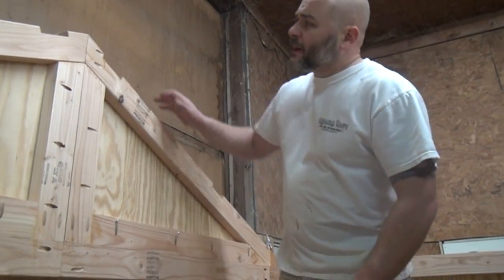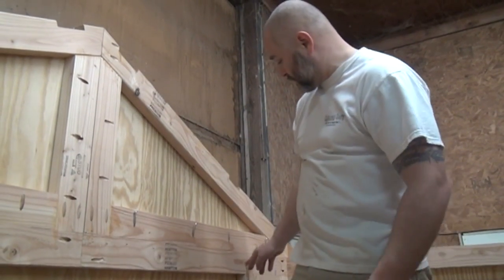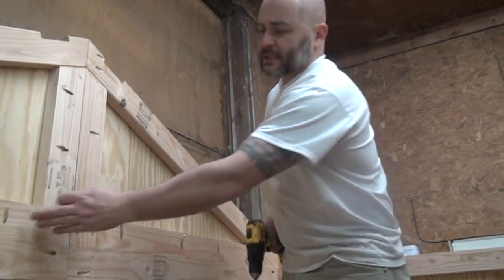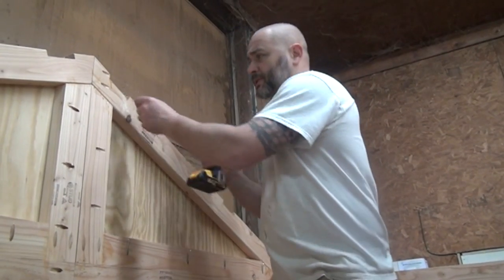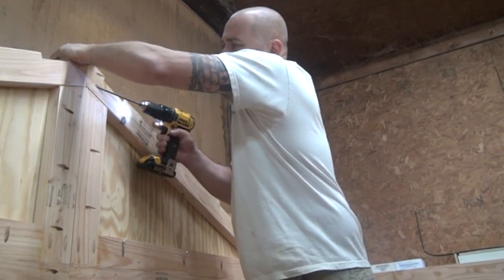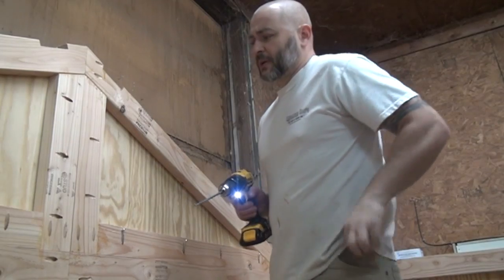What I'm going to do in this case is I got piece F in place. I made sure the little piece of siding fell behind that little piece of trim there. And instead of screwing down first, since this is already stationary and already anchored, I'm going to start by screwing this way. Make sure your peaks are lined up, make sure it's flush. Since that one's stationary, I'm going to let the screws force that one true that way.